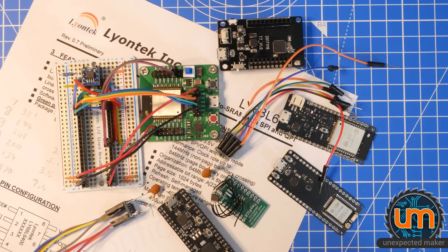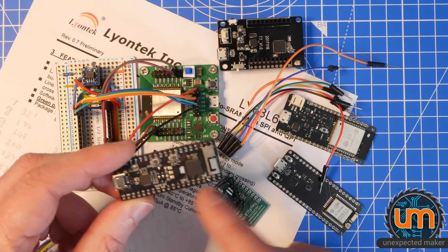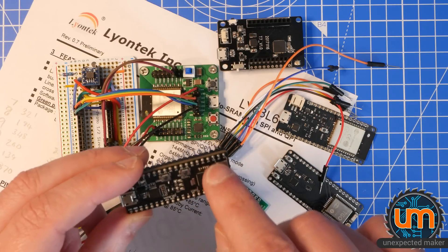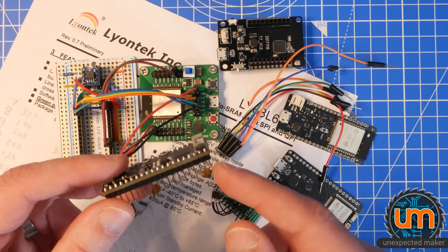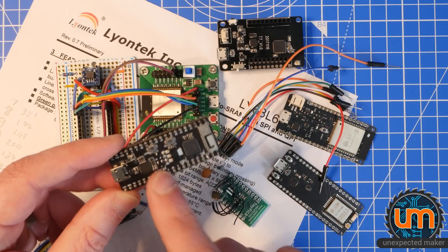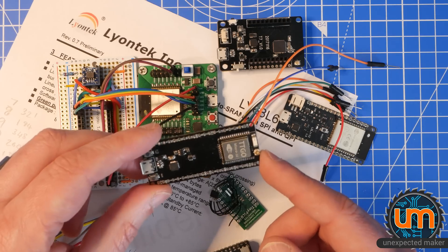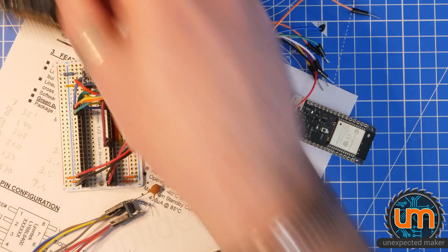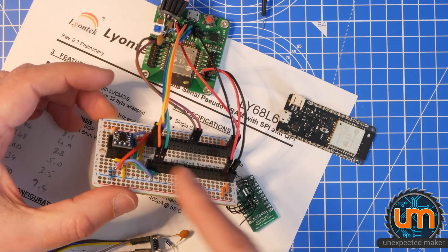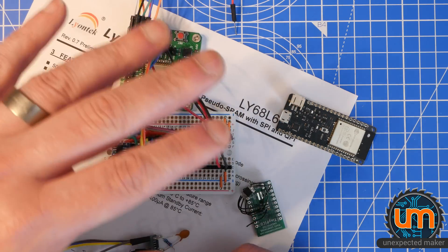The first biggest problem is there's only one Pico board I can even try this on, and that is the PicoKit, because it's the only board that has all the pins broken out. Some of the pins we need are the last three on each side, which aren't normally soldered onto the board with pin headers — there are headers there but no pins — so I've had to put some pin headers in. It also uses some other pins, 9 and 10. Every other Pico board I've got doesn't have all the pins I need broken out. The only one I can test on is this rig, which has female headers and the Pico plugs in, along with my PS RAM.